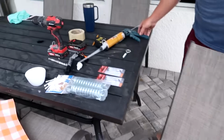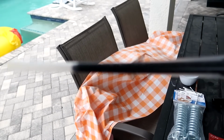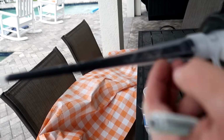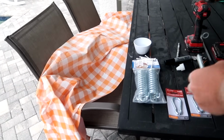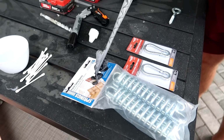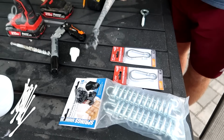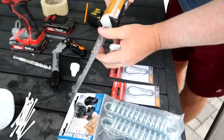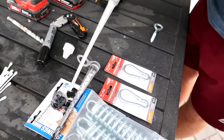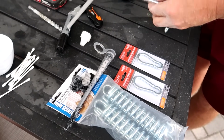All right, so we got our Sikaflex ready to go. Mix up. Look at this fun. Sometimes you have to waste some at the beginning of it until it's mixing gray. You see how you're just now starting to see the white come into it. So what can I spooge that on? Minutes. There, those dirty dog Lowe's. Oh, there's another one though, right? Honey, Lowe's is a piece of junk, bro. Okay. I need both of them because they don't, you know. Can you cut the end? Now I'm going to waste the whole tube. Yep, so see, once you get that consistent color coming out, you're ready to make some cement. See how it is? You don't want to make that mistake and use this first or it'll never set up.